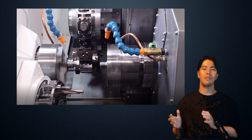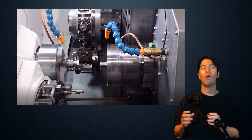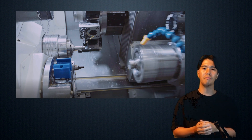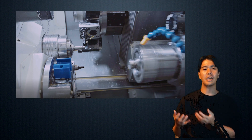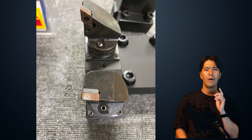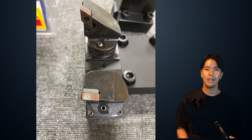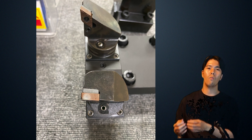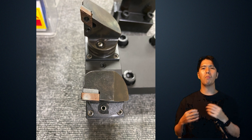I'm sure some of you have noticed — there are so many tools on the machine. In general, it can hold 33 tools. That's more than the 24 to 30 tools of two normal lathe turning machines. The upper turret is normally equipped with 12 tools, but by using the intermediate index function, it can be equipped with 24 tools — turning tools, not milling tools, but this has great effect. In the case of mass production systems, there's a spare tool function that automatically switches to the next tool when the tip wears out if the same tool is installed more than once. It functions just like a machining center, making it possible to automate for the long term.